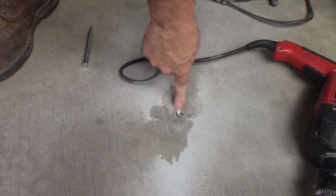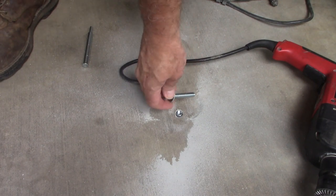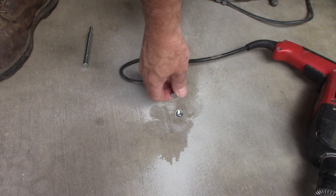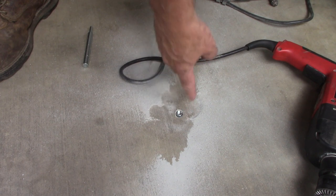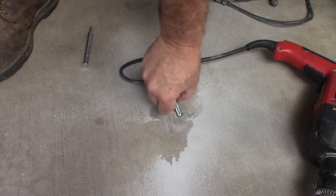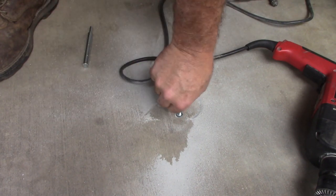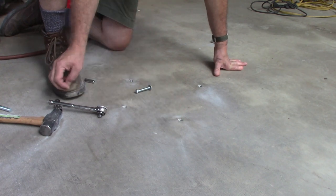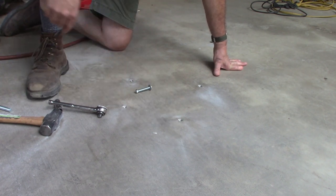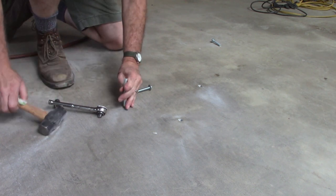This is going to make a really nice setup — I can still sweep across here. What I plan to do when I'm not using these is screw some little short bolts in there so the heads will stick up just a little bit, but that way they won't fill up with dirt. When I want to use them I won't have to clean them out. Be sure you blow your holes out completely before you put these in, because you don't want to be compressing them against dust — that's going to come loose.